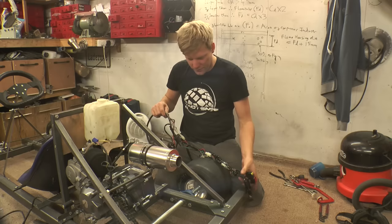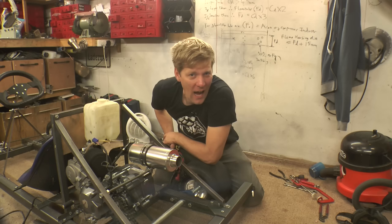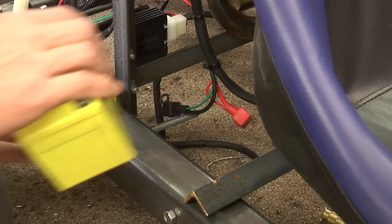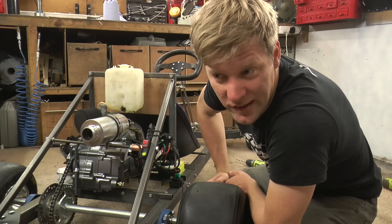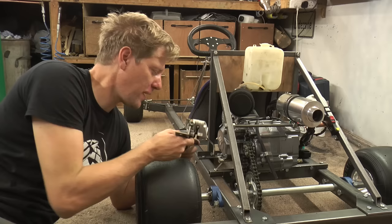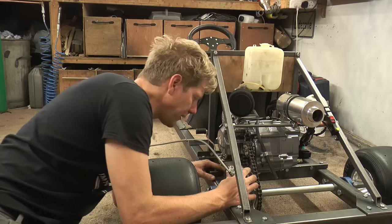The only complication I've got on this one — which you might have too — is I've got one with a starter motor, so you've got a starter solenoid which basically needs hooking up to the battery. I'm going to stick the battery down here because we've got loads of space around this go-kart, and by the time we've clipped and cable-tied it all up it'll actually look quite neat and not so complicated. You're going to need a lot of cable ties for this.